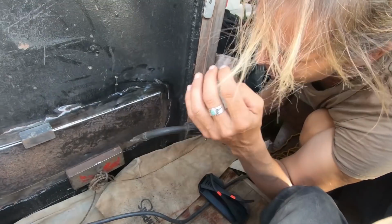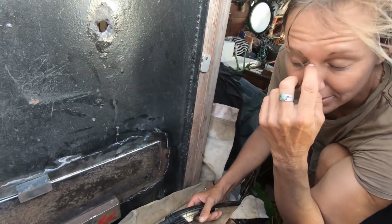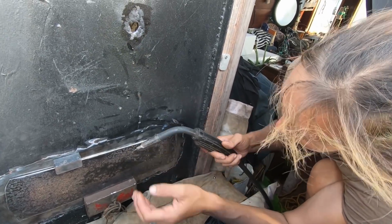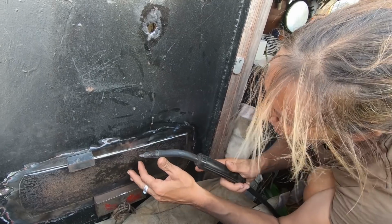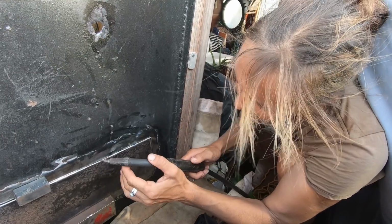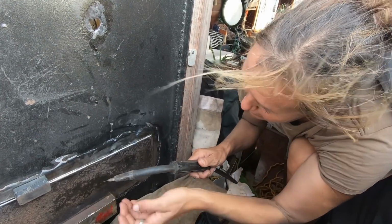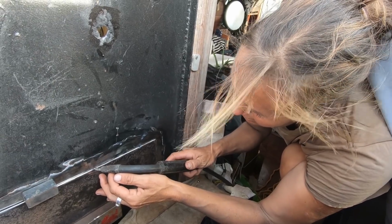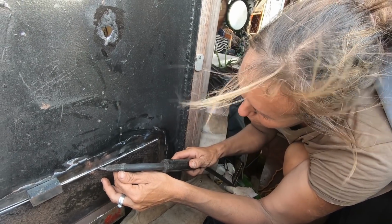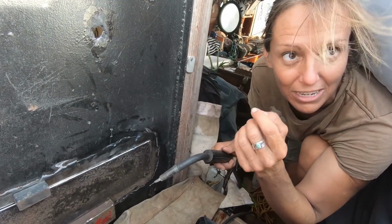In the long term you have to understand what's the most comfortable way for you to weld something decent. It all is about being comfortable and the angle of the rod versus the head of the welder. For me, if I'm sitting that way, I always end up leaning a little bit to the direction I'm working. First of all, just go ahead and you're going to penetrate this first, the standing piece, not this working piece. Until it starts to heat up, and then start working your way to the other piece, and you'll just want to do these little small rotations, just 3 or 4, just for the tacking. Just do it once for me, just to see how you're doing.